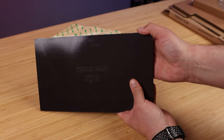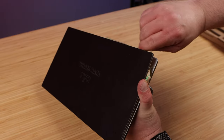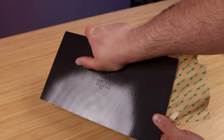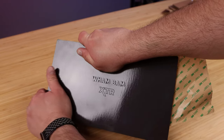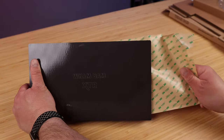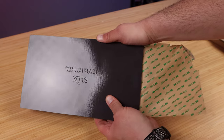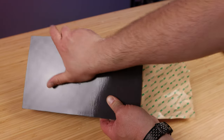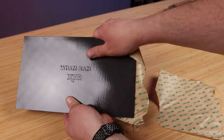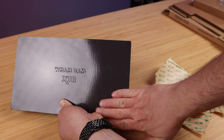It is much easier if you can set your plate straight on the table — then all you have to do is start pulling your paper backing out, making sure you're straight. Push it down making sure it's flat and that the adhesive is sticking. Your paper backing is way out here and you can slowly pull it out. If it's off a little bit you can still push it down and hold it while pulling in, and slowly pull your paper out until it's all out.